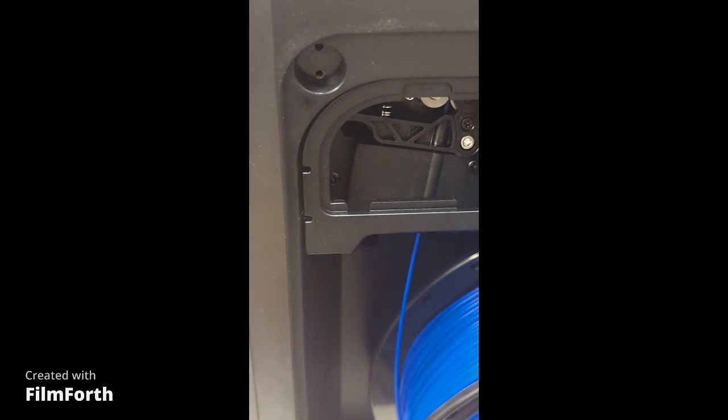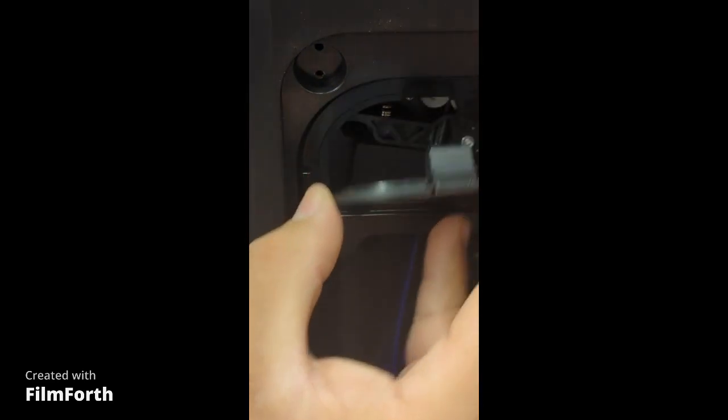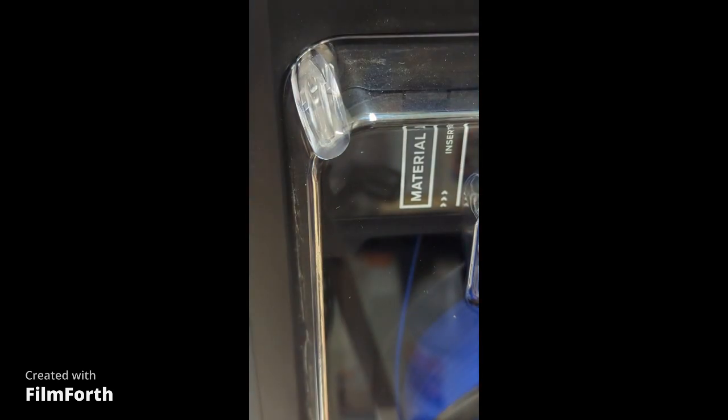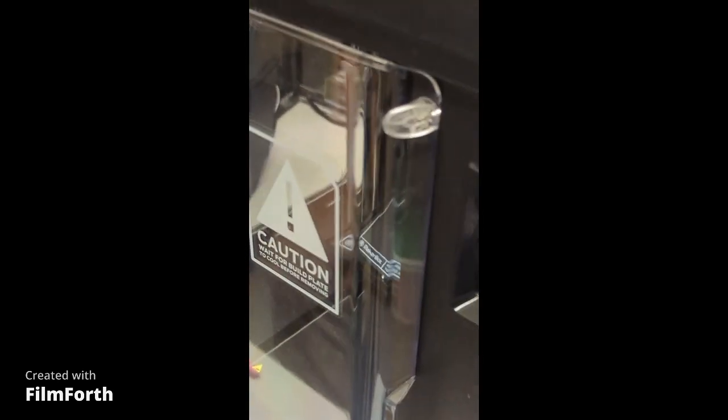So don't do what I did — don't press okay yet. Once you hit load it'll extrude inside. Once it hits the nozzle it says wait till it's extruded — don't press okay until you see the filament extruded outward. That was my mistake. That way you'll see the blue filament, or whatever color you have, coming out of the nozzle. Okay, that was it on my side. Close this little tab right here — make sure the tab falls down below and on top. Look at that, this guy has magnets on the side, so just put this panel back on. Voila!